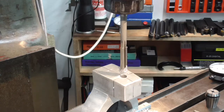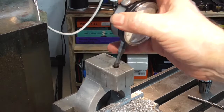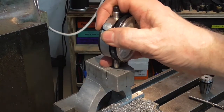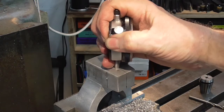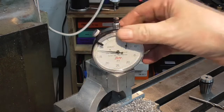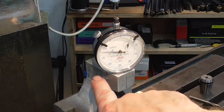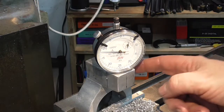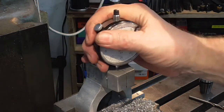I'll get this out and see if our stem fits in — try it with this gauge. Snug. Beautiful. That'll do. I'll get the other hole drilled there now and tapped for the lock screw.